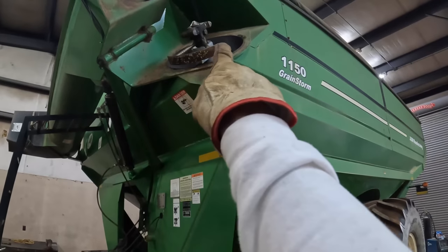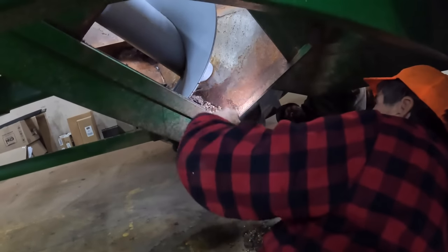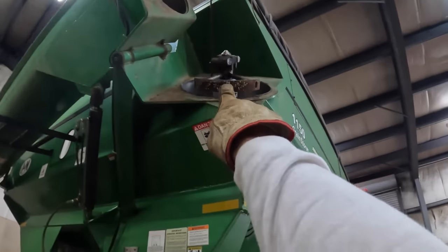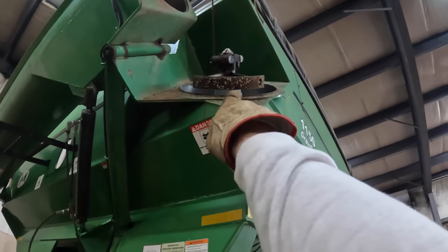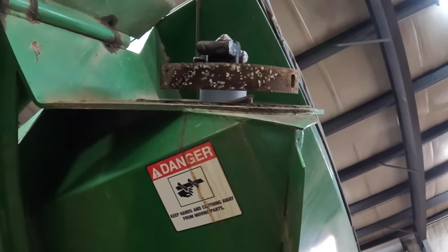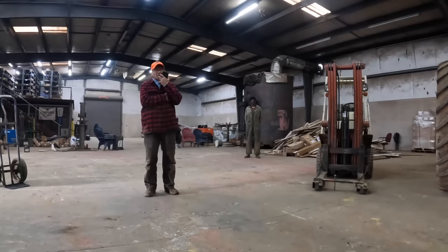It's got this bushing on here. You see gears on that first lip, don't you? Right. Maybe they got the wrong auger. That little bracket right there, it's got two bolt holes. That is supposed to be inside that tube. It bolts onto the inside wall. That's what holds the top part of the auger in place, and you see how much we're sticking out. We ordered the bottom auger and we got it in the hole, but it's too long. It's sticking out.